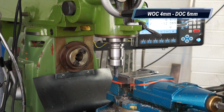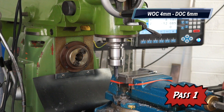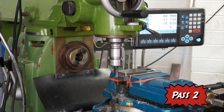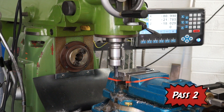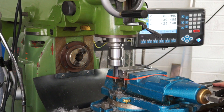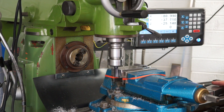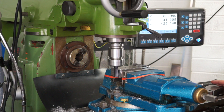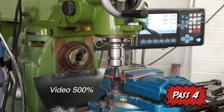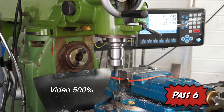To rough this down to size I won't take a full depth cut. My depth of cut is 6mm and I'm doing a 4mm step over. This is a 12mm Evolute end mill designed for steel — coated carbide of course — supplied by Live Tools, the agent here in Australia. Once I get to depth you can see my multiple passes starting to eat away at that side, bringing it down to length.